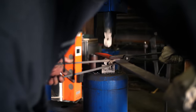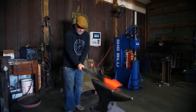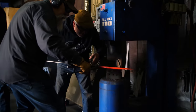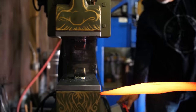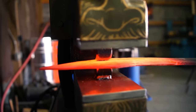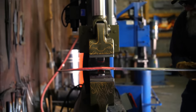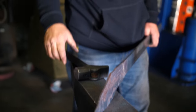Yeah, that looks a lot better — see that line we're knocking out right here. Get it hot again, doing good. We're going to work across the dies this way, starting at the point, across the dies like this. Take your time and be real — can you feel it in the groove? Good, nice. Good job — now that back is wrinkly of course.